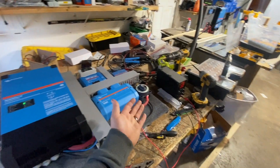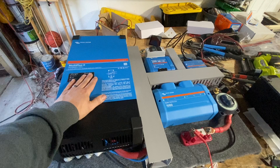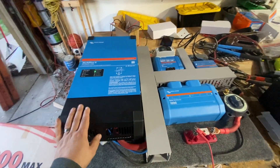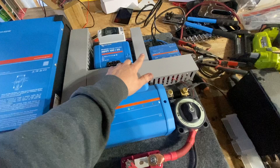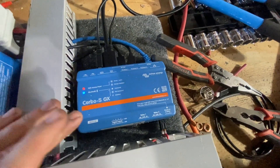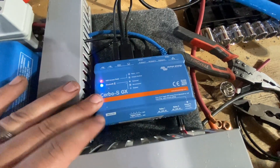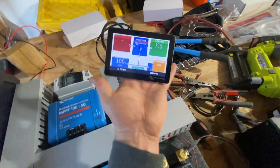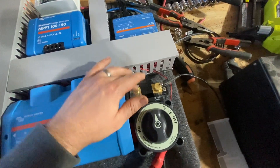Here is the board — this is the operating table. We got it all put together today; spent most of the day working on this. We got the Multiplus 3000 — we were originally planning a 2000, but they wanted a little bit more overhead to run the microwave, and it's about a $450 difference, not a big deal. We did decide to upgrade to the Cerbo GX, and this time we're using the Cerbo S GX. The only difference is we lose tank inputs and the BMS CAN ports on top — for most people not a big deal, but it saves you about $70. And because we're going to that display, we can use a SmartShunt, not the BMV, which saves a little money there too.